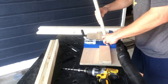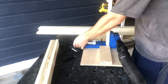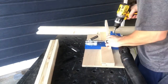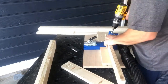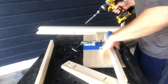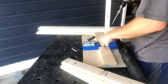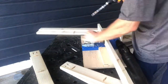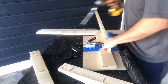The tops are also going to be attached by pocket holes, spaced out pretty evenly. I usually like to mark all the pocket holes out first so you don't accidentally screw one the wrong way. One thing I do — I constantly check the depth of the bit just in case it slides, because that does not make for a fun project if it gets too deep. Ask me how I know. For the spacing of the pocket holes, I like to go about 3 to 4 inches from the ends and then 6 to 8 inches spaced evenly throughout the rest of the way.